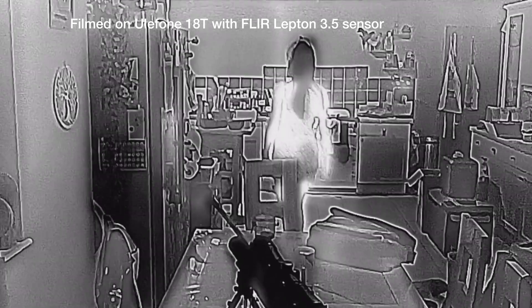One main difference between the type of sensor embedded in a thermal camera equipped smartphone and the X-Infrared X2 is that smartphones typically offer a hybrid view combining the standard camera lens and the thermal image processed together, while the Thermal Eye app and the X2 sensor only offer thermal view. But in practice I found the resolution bump more than made up for that, with a far better and easier to understand thermal view than I'd previously tried with built-in smartphone sensors.